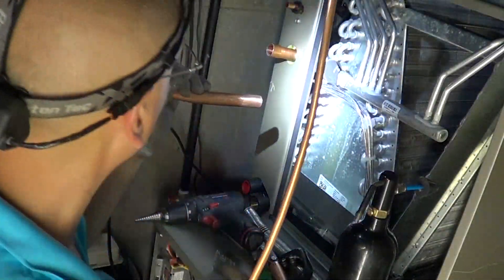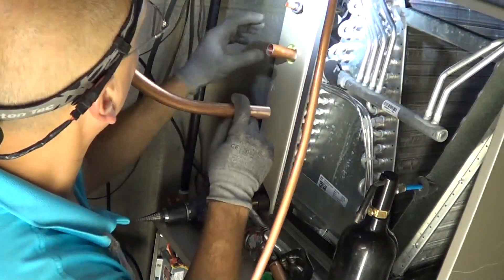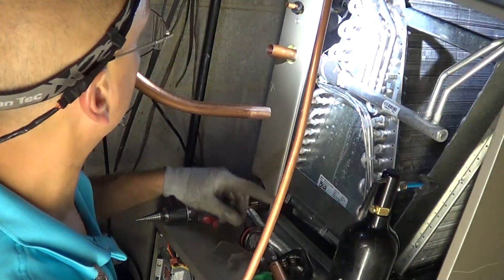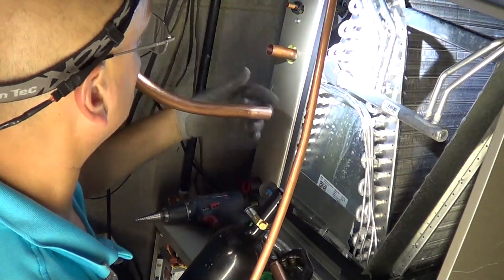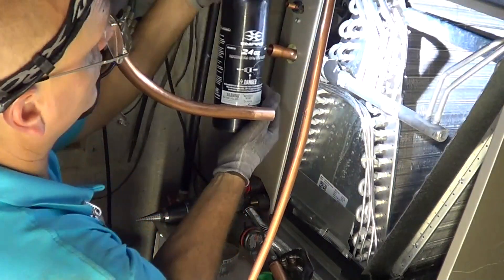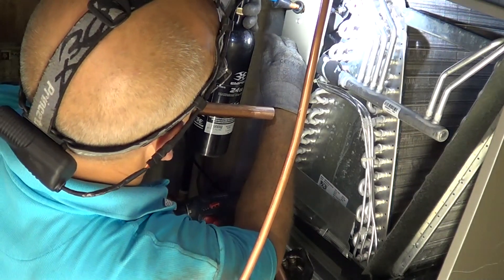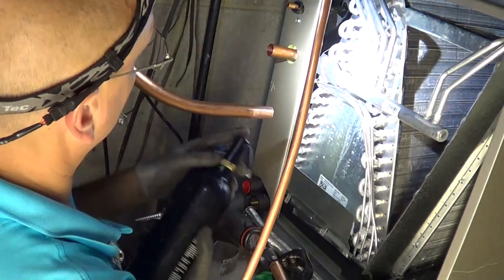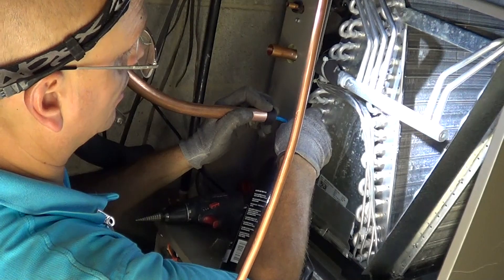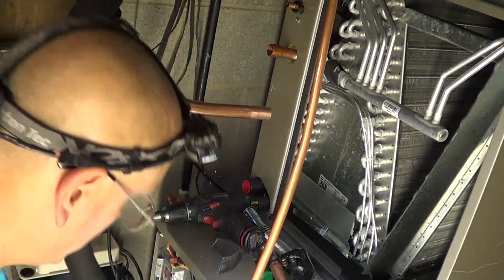Connecting the pipes here. I wanted to show how I'm going to solder it, and also see how there's a bunch of sand in there from sanding - we're using wire mesh sandpaper. It's important that all that grit is out, especially in the pipe. So what I do is blow it out with my trusty CO2 can - it gets it nice and clean. I already capped the other end, and that makes the pipe nice and clean.